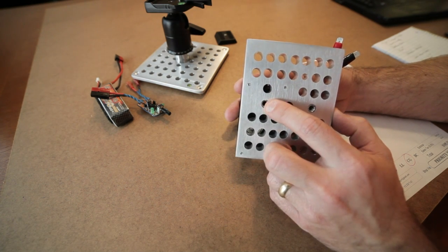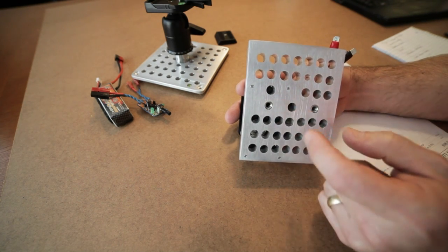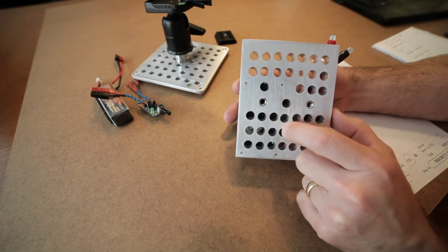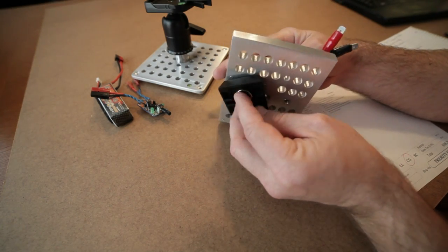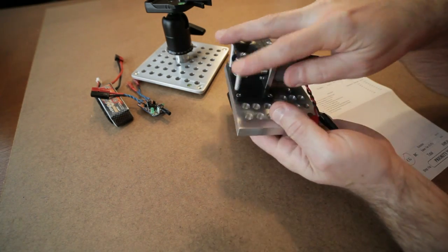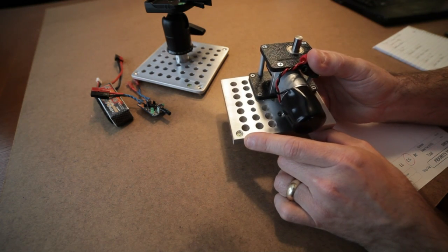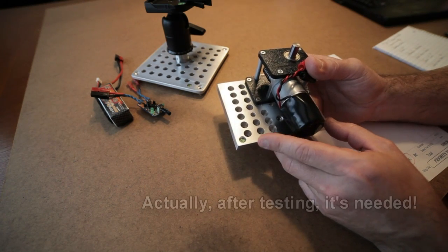Keenserts. They're 1/4-20 inside. The outside, I forgot what the thread is, but basically you tap that, you screw in the Keensert, and there are 2 legs, 2 tangs that protrude outward, and you tap them into the side and they lock these 1/4-20 inserts. And then ultimately you have a tripod quick release plate, and you're going to screw that on as such, okay, and then that's going to mount to your tripod. I also bought a bullet level indicator here, and just drilled that in and epoxied that in just for level indication, not needed.